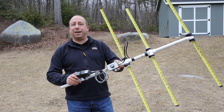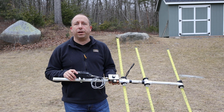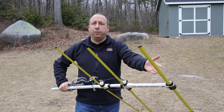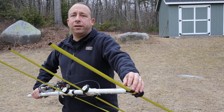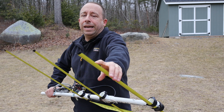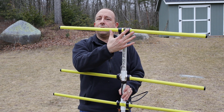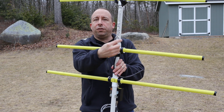Here's a look at the bigger antenna. This one was cut for two meters, or the 144 megahertz band. Bill constructed this more or less the same way as the smaller antenna, using cheap tape measures and in this case three quarter inch PVC pipe. He's got tape around the hose clamps on the elements and tape on the ends of the tape measures so nobody cuts themselves on the sharp edges. Once again we've got a director, the driven element, a reflector, and a little tuning stub.